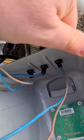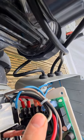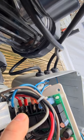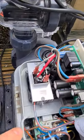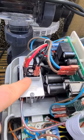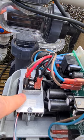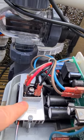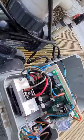This middle wire goes to the salt cell. We're going to take those two wires and lift them out of their current positions on the board and wire them into these two places instead, leaving those original spots completely empty. The rectifier replacement is something some people have done successfully — you can pick one up for two or three quid at a radio shack. There's a model number on the front so you can look up the exact part.